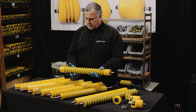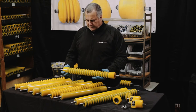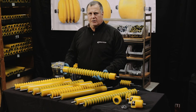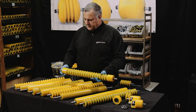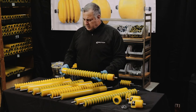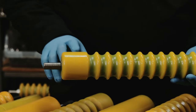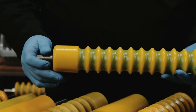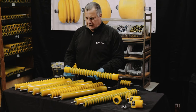This is a special roller for anti-shadowing effects from the double cut of your reels. You would install these on the back mower reels of each of the mowers. So you'd only need these on a set of five — you'd need two of these for the back reels. They would go on the front, and the smooth ends, about two-and-a-half inches wide, to minimize the double cut and the shadowing lines associated with that.